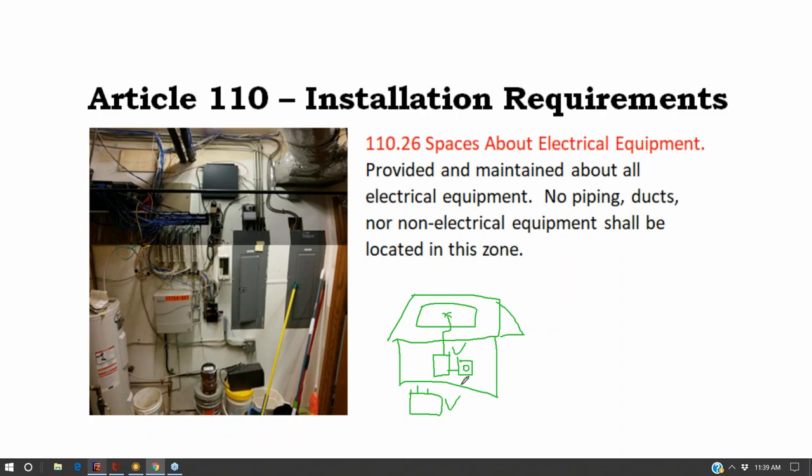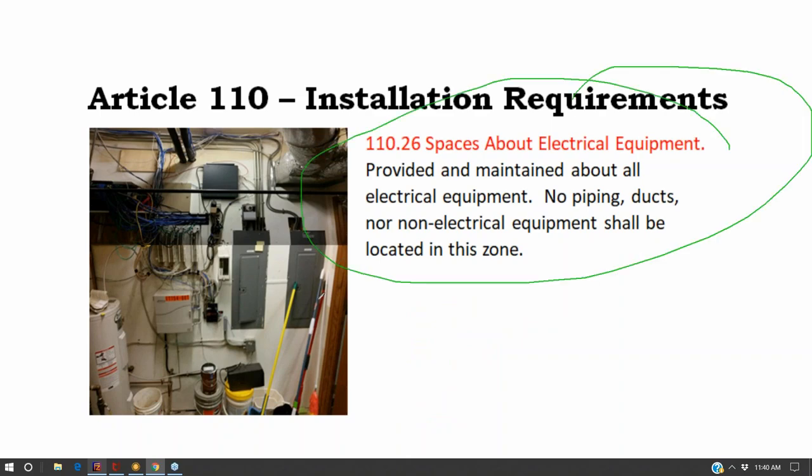Well, okay, but even so, elevated temperatures are going to reduce your inverter performance and they're also going to reduce your battery life. And so, what I really like doing is putting all this stuff inside of a closet or a custom built box. And it starts taking up a lot more space. So, what we have to remember is that all the space around the service area of your electrical panel needs to be dedicated for electrical.